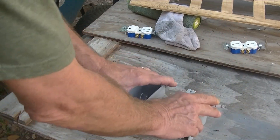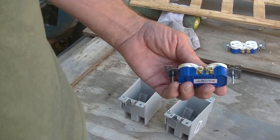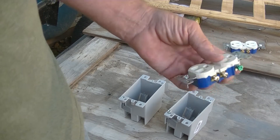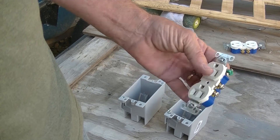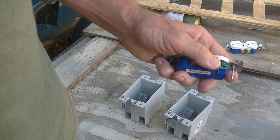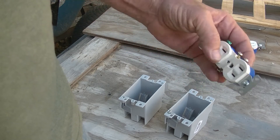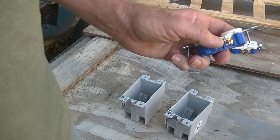How I'm going to wire these: you've got the brass and you've got the chrome. The brass is dark — that's the black wire. The white is chrome — that's the white wire. And the green is the ground wire. The way I remember it is: black is brass, or it's your ass.